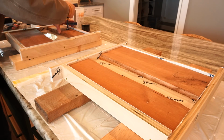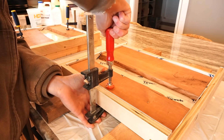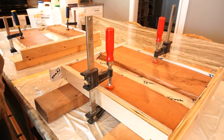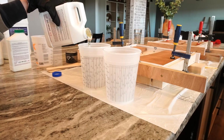The resin that you use will tell you specifically what temperature to pour at, but typically about 70 degrees is good. I set out some trash bags on my island to protect it, clamped my wood pieces into the molds, and prepared to pour. Because this board was about 5/8 inches thick, I used a deep pour resin formula. There are a lot of brands and options for pouring thick resin, but make sure that whatever you use is able to be poured as thick as your board.